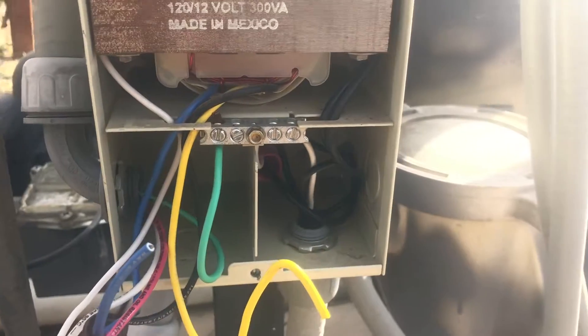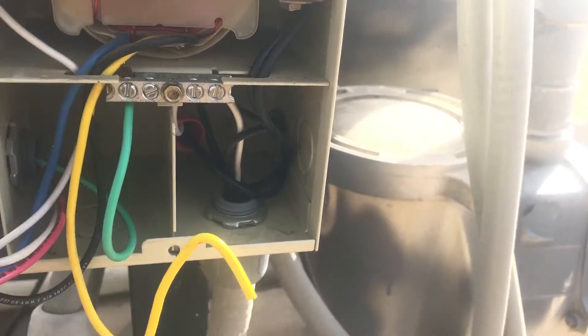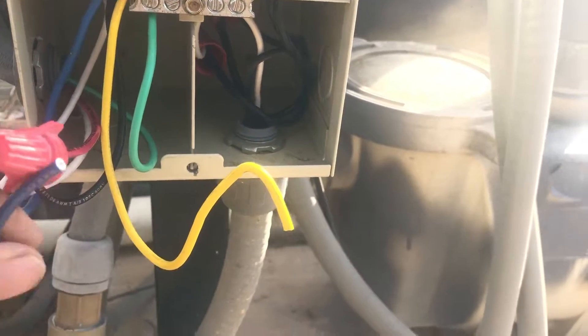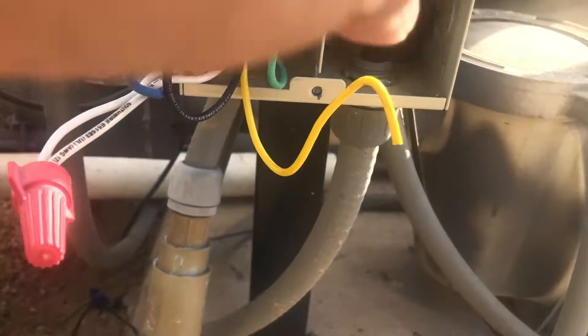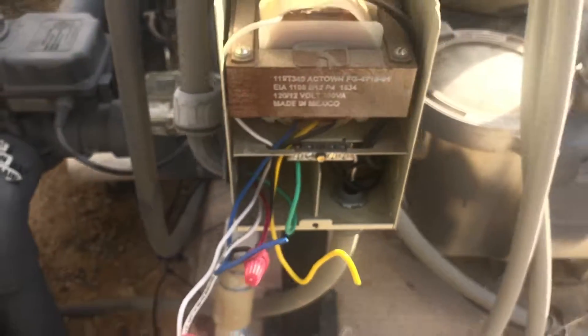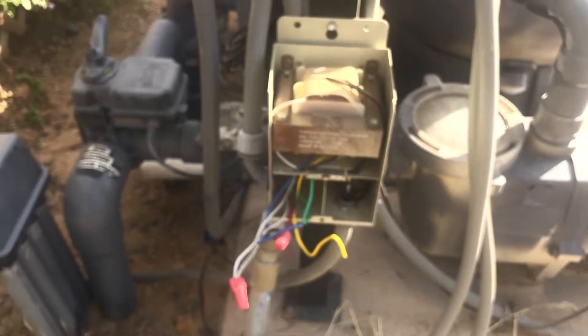If you connect white and yellow it will produce 13 voltage, and white and blue will produce 14 voltage. I've seen some transformers where you just have two input wires - you connect white and black - and then on the output side there's a terminal that tells you to connect a specific wire for a certain voltage, like 15 volt. But this situation is totally different - you have to connect the input wire according to the voltage you want. The way you connect the input wire determines what voltage you will get out.